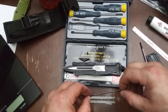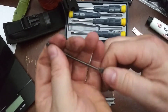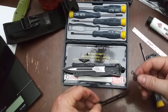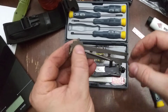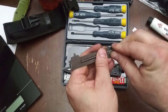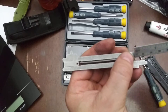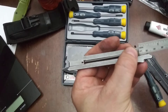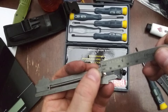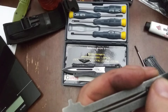I'm going to take the spring off and just freehand pull it. Being very careful. Now we've lost some spring strength but I don't know how much. Let's take a measurement. We're at about 12–13 millimeters — make that 13 and a half millimeters. That's not as far as I went on the other knife, so we'll try that first and see how it feels.